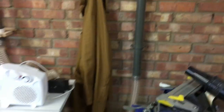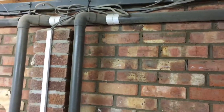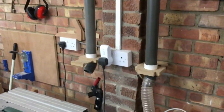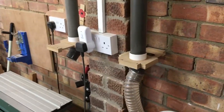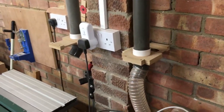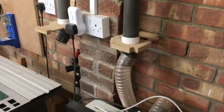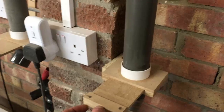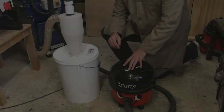I've got the inlet to the cyclone connected to a rising pipe, and then there's a header which runs across the top of the workshop. I've got 45-degree T's branching off at high level, dropping down to the blast gates. We made these blast gates ourselves — there's another video online and I'll put a link in the description, including free plans to build your own from six-millimetre MDF, very cheaply. The outlet of each blast gate is connected to a machine in the shop — you simply open the gate when you want to use the machine and shut it when not in use. The system extends all the way along the workshop to a couple more tools at the end.